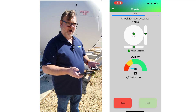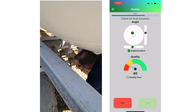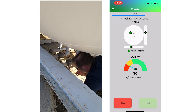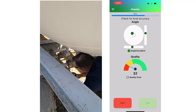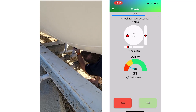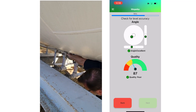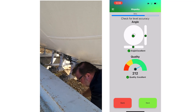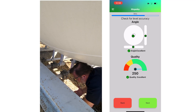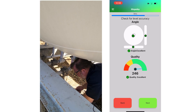Hit 'Next' — you'll now see the level and quality screen. At the top is a three-axis gimbal to help you level the sensor on the tank, and at the bottom is a quality indicator showing how clean the signal is going into the tank. Go ahead and install the sensor between the valves underneath the tank, watching the screen to get as level as possible. It doesn't need to be perfect. Within 30 to 60 seconds, the quality gauge at the bottom will rise. On this bulk tank, it went up immediately and is now fully in the green. With both levelness and quality requirements met, the 'Next' button is illuminated.